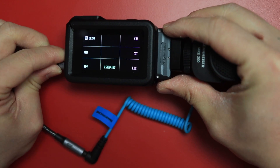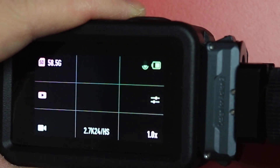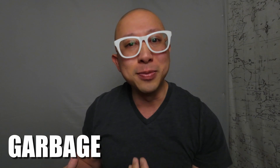Let's first use the generic headphone adapter, since this is the one that causes the most confusion. When we plug it into the camera, we can see there is a mic icon, meaning it does recognize this adapter as some kind of mic input. But this is what the audio sounds like using this headphone adapter with a TRRS cable — the Sennheiser MKE 200 with the generic USB-C to 3.5 millimeter adapter. You can hear that while it does work, it sounds a little dodgy, because this adapter isn't transmitting the entire audio signal.